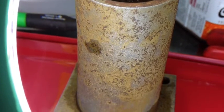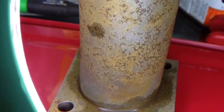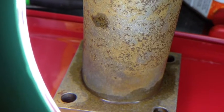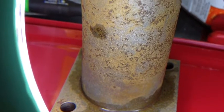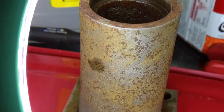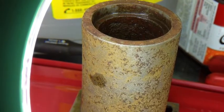You can see it's gray and kind of pitted a little bit — the vinegar is actually trying to revert it to rust form, but because it happens so fast it makes the other rust drop away. Make sure you hose-rinse it really well in water so that it doesn't continue rusting. Once you neutralize the acid it's pretty good.